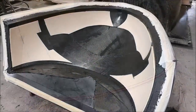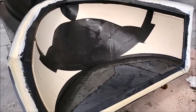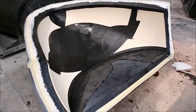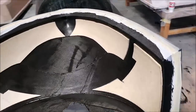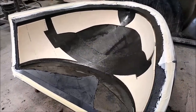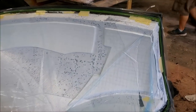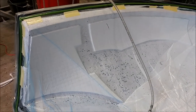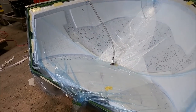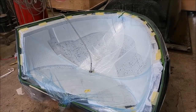Here's the nose with the core pieces laid in there. We use half-inch scrim core — it's kind of scored on one side and has a fabric backing so it can mold around corners. Here it is with the peel ply laid down and the usual vacuum bagging breather fabric. The process on this one was similar to how we did the core for the lower part of the fuselage — we do it in two stages: get the core in first, get that all bagged and sealed, then come back and lay the inner layer.